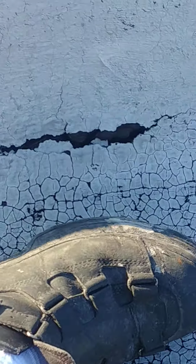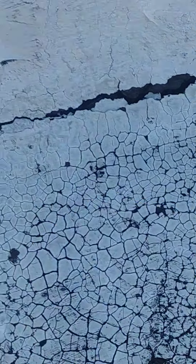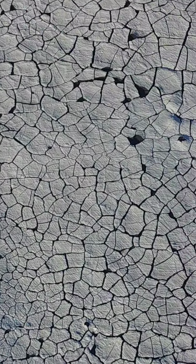See this? Here's my foot for comparison. That's a size 11, so just to give you an idea, you got an 18-inch gash there. So yeah, it's an old hot asphalt roof. She's done. The good news is I'm a big boy, so jumping up and down on it, no structural issues whatsoever. 6.5 square, this is easy. This is blowout. Run new rubber on it.